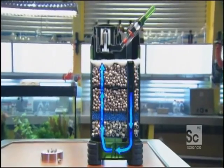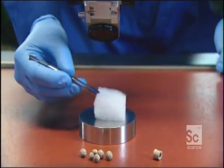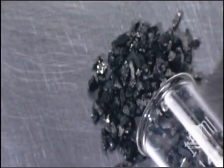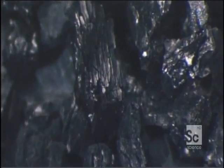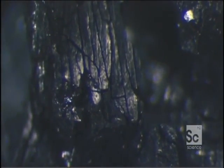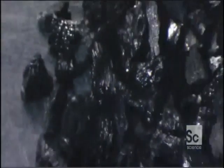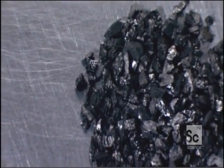The final phase is a white filtration pad that allows only the smallest particles back into the flow. An activated carbon filter can occasionally be used at this stage to trap organic molecules. This carbon is very porous — flattening the microscopic pores of only one gram would cover the surface of a basketball court. That means a lot of mini traps to rid the water of unpleasant odors and additives.